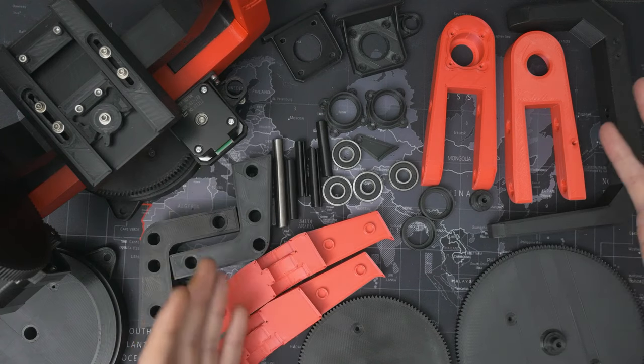It works but it tends to be quite brittle and it can grind away on things like these little gears on the motors. But I wanted to see how everything went together and if I'd need to modify any parts to better fit my needs - and I did need to modify a couple of pieces. Specifically this big 160-tooth gear that sits on this side, and this arm the camera mounts to, and I'll explain why I modified them when we get to assembling those bits.